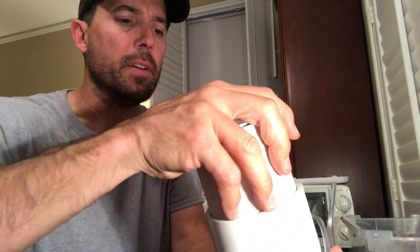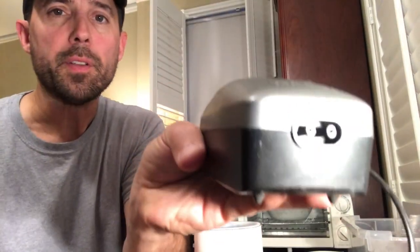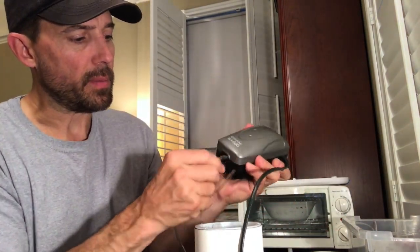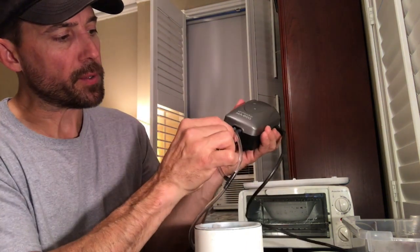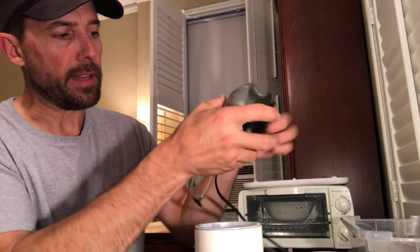Have the lid on your paint when you're getting ready to insert it into the base, and all you simply need to do is just take it and wiggle it down in there. It doesn't need to go in very far, and at that point you're ready to connect your hoses to your pump. And what that simply is, just grab the pump. I happen to have a pump with 2 valves on it right here, and it does not matter which one goes on the right, which one goes on the left, and I just slip them on there just a teeny little bit. Here is another warning.